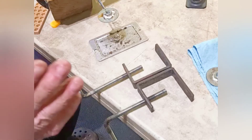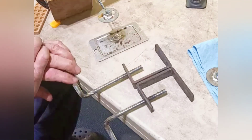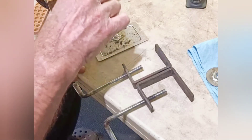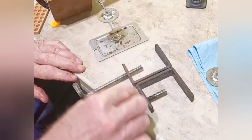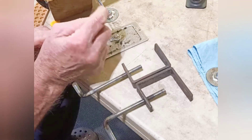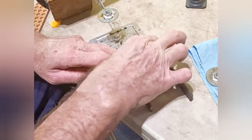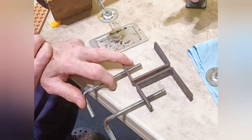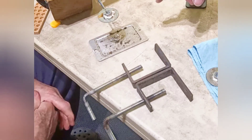I made them originally out of eighth-inch mild steel. This is quarter-inch mild steel — the eighth-inch is usually what your clamps are when you get them, but that's hardened steel. I know how to harden steel, but that's a lot of work. These have actually been used for two or three years, and he's reworking them now because the originals wore out. I love the smell of hot brass — I used brass as the joining material, and that works really great. The problem is, I want something that'll break loose from the washer before it damages the clamp configuration. The brass is hard enough that it would stick to the nut and washer, so if you tightened it too much it would distort the clamp. This will break — the nut will come loose. You've created a first-choice failure position to avoid other damage — it's my fusible link in this particular circuit.